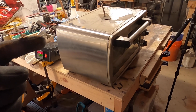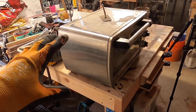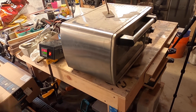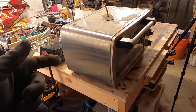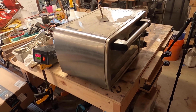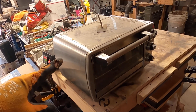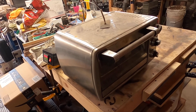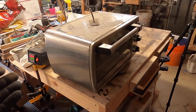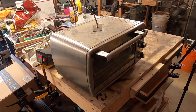If you're trying to pull a warp out of the blade in the temper, I would recommend tempering it for the first two-hour cycle first. After that two hours, then you can put it in the jig and try to pull the warp out on the second temper cycle. If you try to do it on the first cycle, the blade is still brittle and you could break it just trying to straighten it out. So we're going to set our timer for two hours, come back, pull it out, let it cool to room temperature, put it back in, and after the second cycle the heat treat process will be complete.